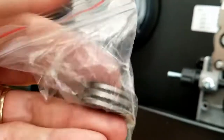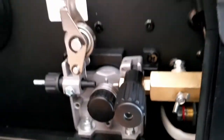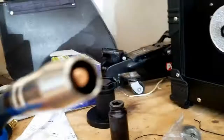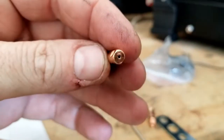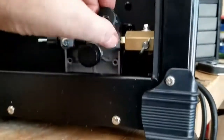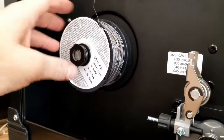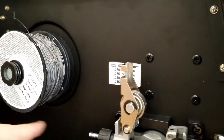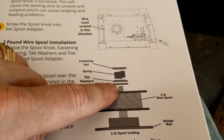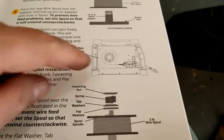It comes with a .025, .030/.035 solid roller, a .030 and a .040 knurled roller. There's a chart inside that tells you exactly what's what. The MIG gun comes with a .030 tip already in it; they give you a second .030 and an .040. Pay attention to the groove sizes — the numbers are a little screwy. Everything here is plastic except for the spring; even the nut is plastic, so be careful with that.